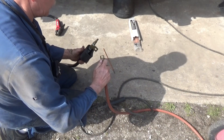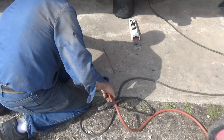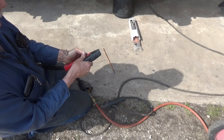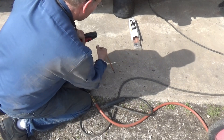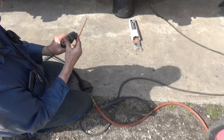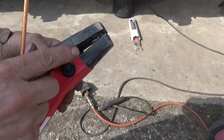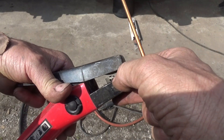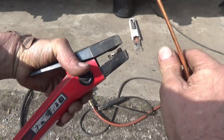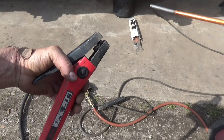I'm going to hook up my air on this thing. It's got an on and off button here — this is on and that's off. Put an electrode in, and you want to put it on the same side that has these little holes. Let me see if I can show this on the camera. These four little holes on that — that thing turns, by the way. So what happens is, this thing blows air out through those holes.